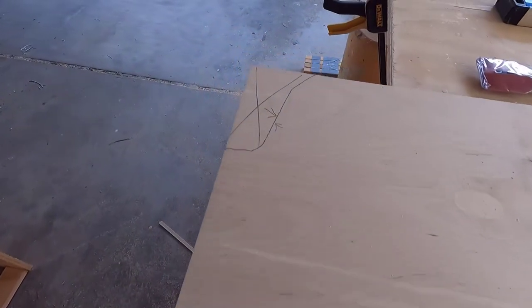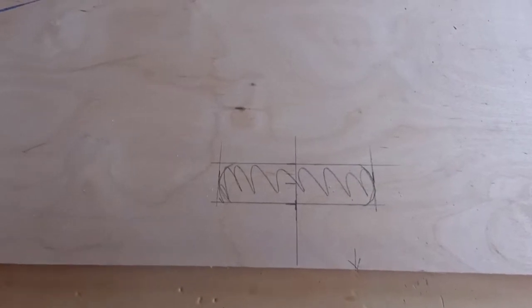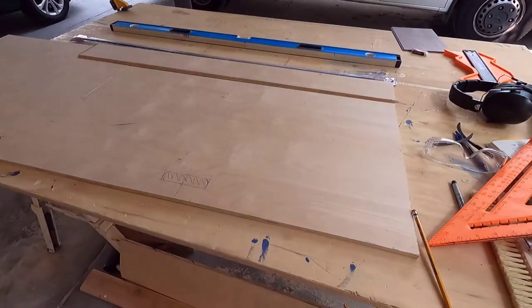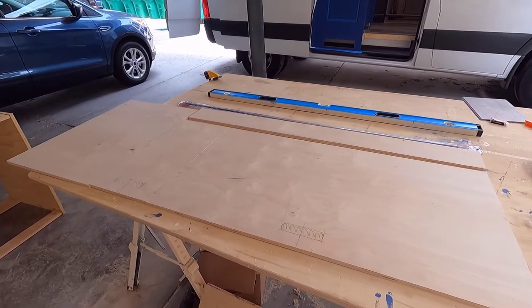There I have all of the marks. It's a jigsaw cut on that edge — edge strip with birch edge. There's a little handle routed, all these arrows mean edge stripping, and then this tiny route here is to countersink the piano hinge — I've worked out how to do that with the quarter-inch router. So that's the driver's side ready to rout and edge strip.